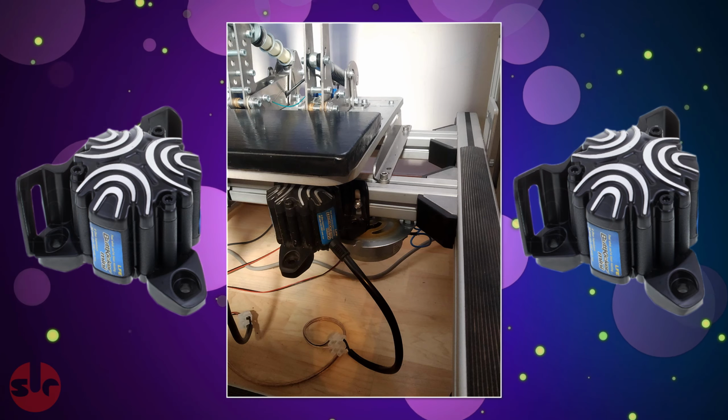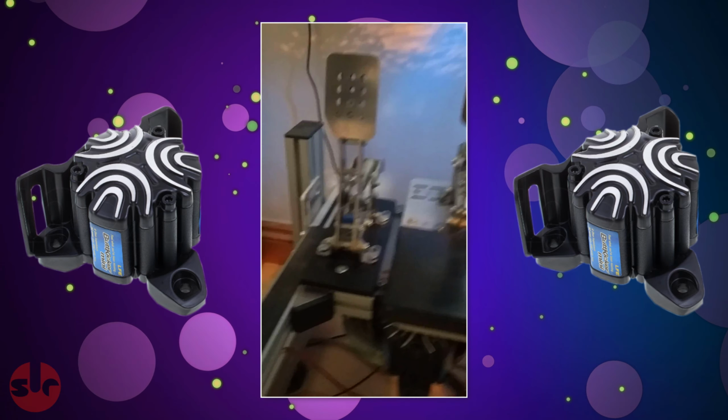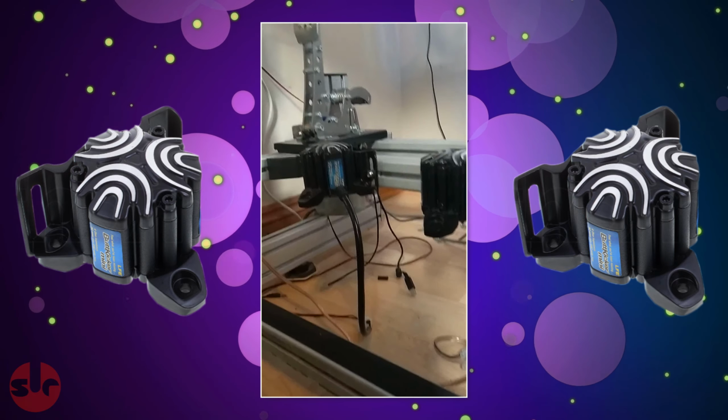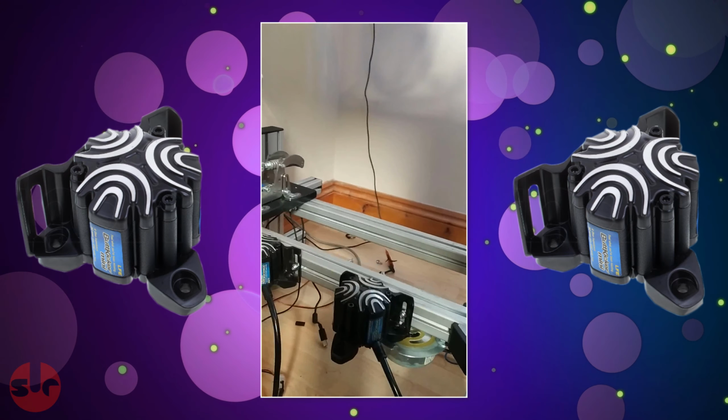The material was great for carrying heavy duty load cell pedals and having no flex, but seemingly counterproductive for the bass shakers. So instead of the vibrations dissipating through the frame, some of that was feeding back to the bass shakers and producing this unpleasant knocking noise.